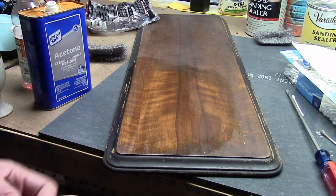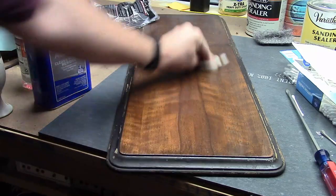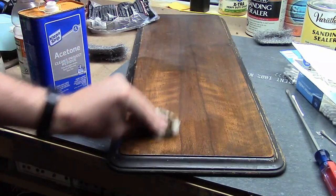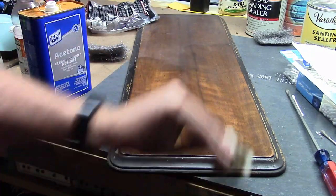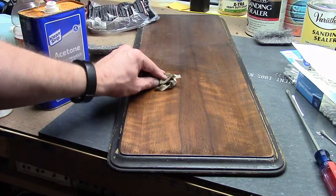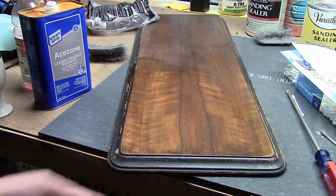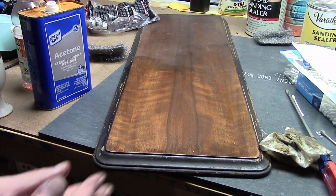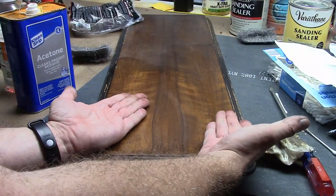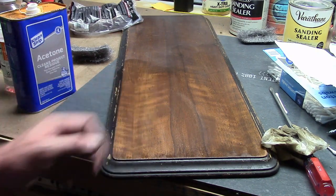You don't need to go with anything more aggressive. Just like that, we've got about half of the top done. Now this outer surround is more like a paint — that takes a little bit more work to get off. Also this finish is not all that thick; sub cabinets have a pretty thick clear coat, this does not. So just like that and we're pretty much down to bare wood — and very pretty wood I might add. Nice bookmatched. Consensus seems to be that this is mahogany, and by bookmatched I mean it's two pieces of veneer. They took a log, sliced thin strips out of it, then took two of them and kind of folded it open like a book and put the seam right down the middle. Really nice figuring in that when it catches the light.